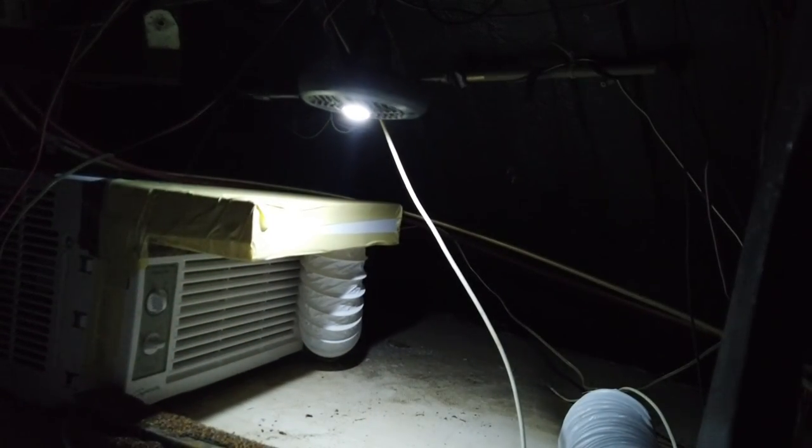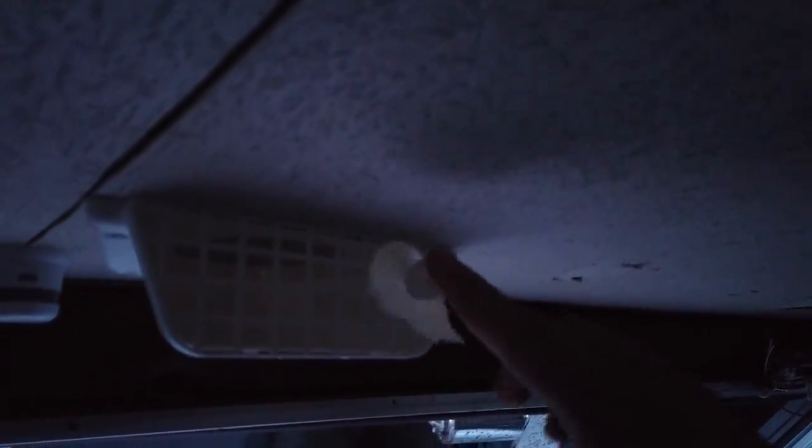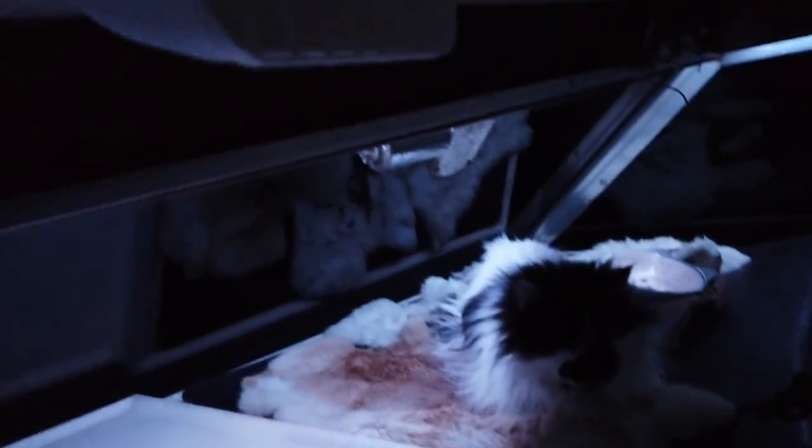And well, that does it. As you can see it's just a real simple setup — you just have to build a duct for your air conditioner to point the air down. Now I'll draw fresh air in from outside when I turn on just the cooling fan, and of course I can turn on the actual air conditioner to get cold air in as well. I've got it working now — the air conditioner is on, you can feel and see cold air coming out. It's not as strong as it used to be but it's still got a good flow and it'll definitely cool down the boat. I think the cat approves. This is how you install an air conditioner for under $200 on your boat — pretty easy, pretty simple. Hopefully that helps somebody.